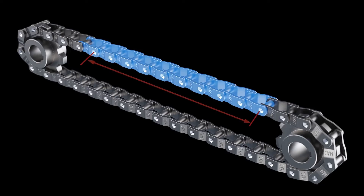We can take a measurement from center to center on the chain pins. We can take the measurement from the left-hand side of the rivet head to the left-hand side of the rivet head, 10 rivet heads up. We can take the measurement from the ear of the sidebar to the ear of the sidebar, 10 pitches up.